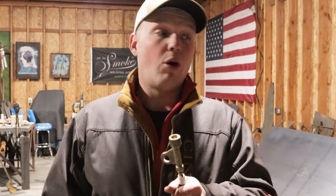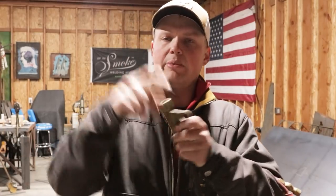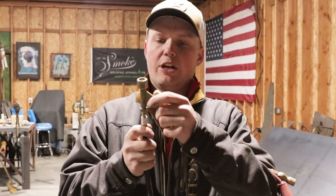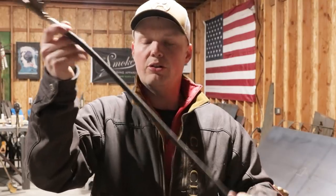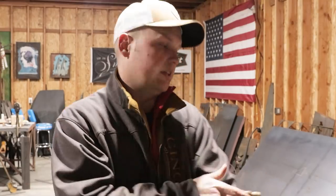A lot of people are going to look at you, especially in the structural world, and they're going to be like, what the heck are you doing? Well, you just don't understand. That thing will arc off through paint. I don't know how it does it, but it does it. But anyway, so you have a block. This is going to be hooked to a purge hose, and then you're going to have your connection right here. It's got a copper line that runs through your TIG, through your liner, and that's what's going to be making your connection to your tungsten.